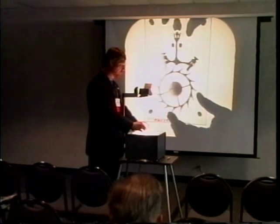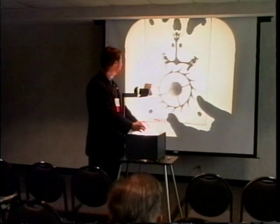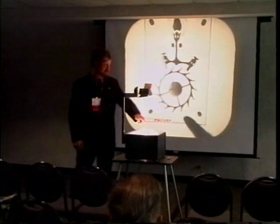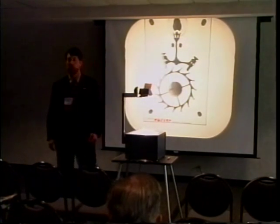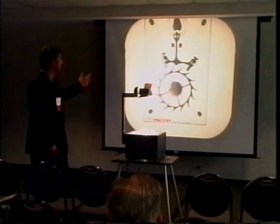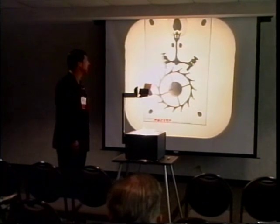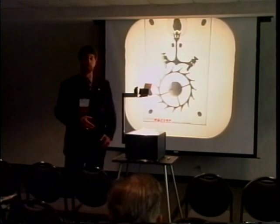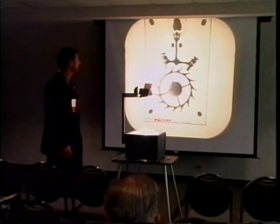Watch, it doesn't have a beat regulator. Before we start timing it, there's no power on the watch. You can see the escape wheel is not contacting the pallet stone. So a dead rest, or it's in beat. The watch is in beat. Okay, it's dead rest. It's in beat.